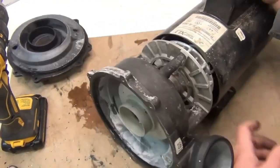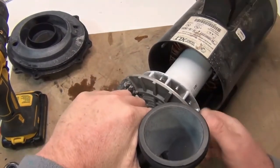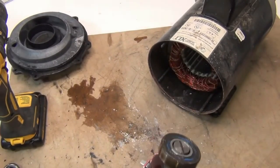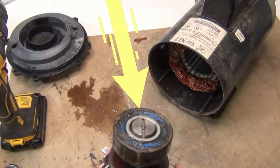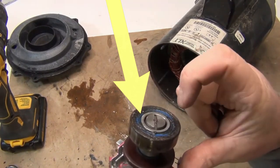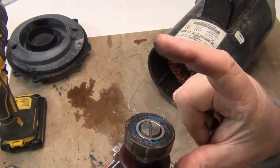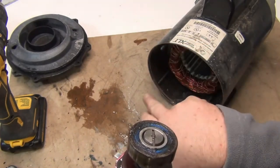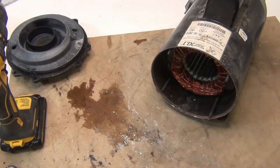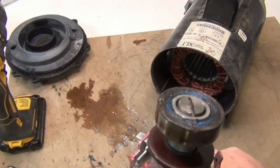Once you've got that popped out slightly, bring it out carefully. When it comes out, look on the end — normally there's a compression ring. Sometimes it gets stuck on there, so clean it off and re-grease it. Check inside to see if the compression ring is there — sometimes it falls back down. We need grease back on it.